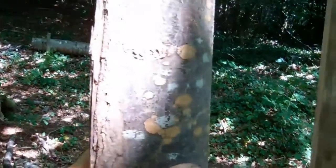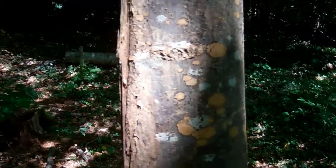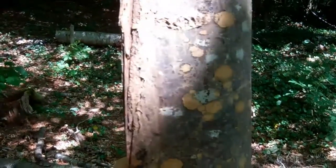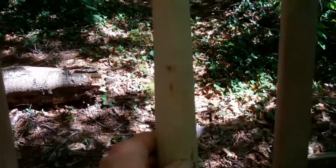We'll be looking at working with ash today — Fraxinus excelsior — and we're going to start with pieces that are split out from the round from the tree. This one's seasoned a little bit and I'm going to take it through a couple of stages of roughing out till we get to the approximate shape we need. At some point later we'll begin a process called tillering, or shaping the bow to bend round into the correct shape.